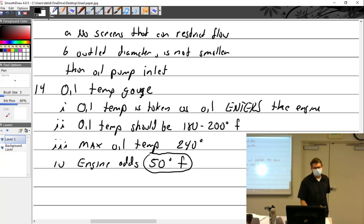Oh, just go out there and run the plane up, run it for a little while, shut down, and they never get the oil hot enough. So you expand the air, the engine cools off and sucks in more water. Yep. So you're better off doing nothing.